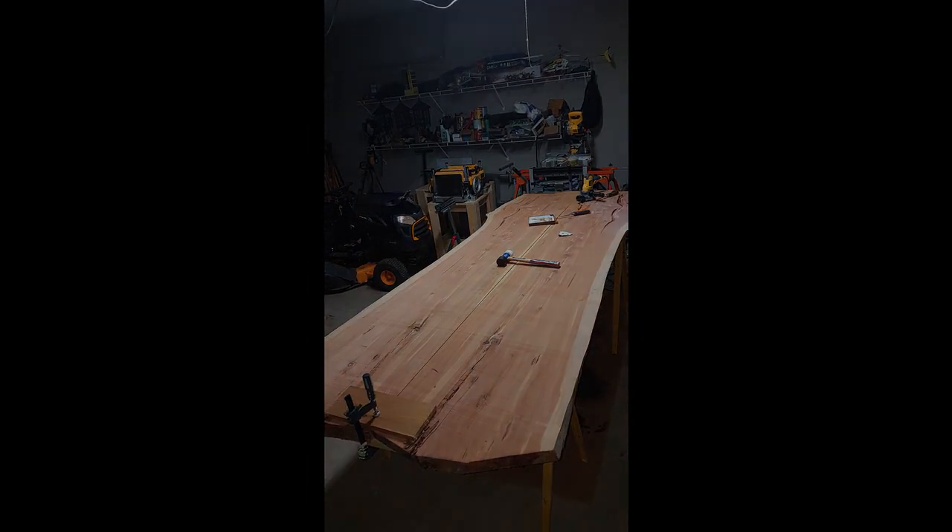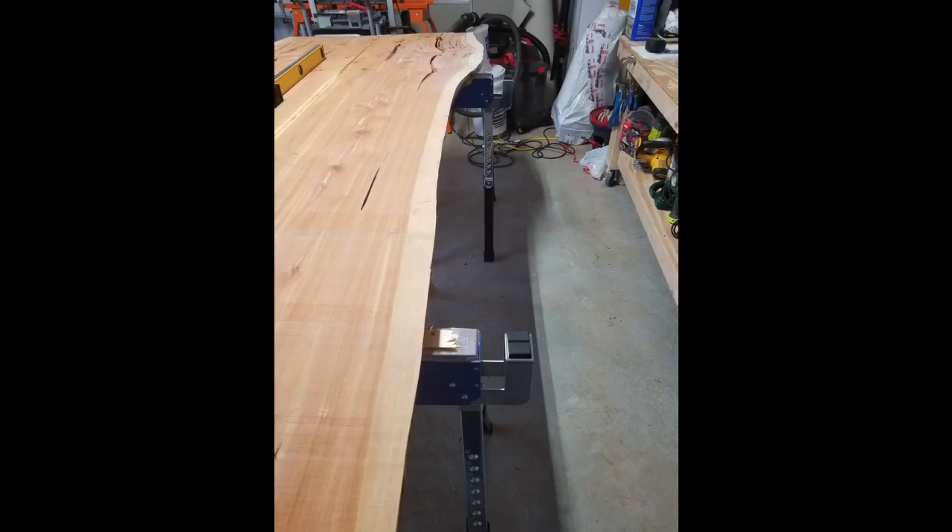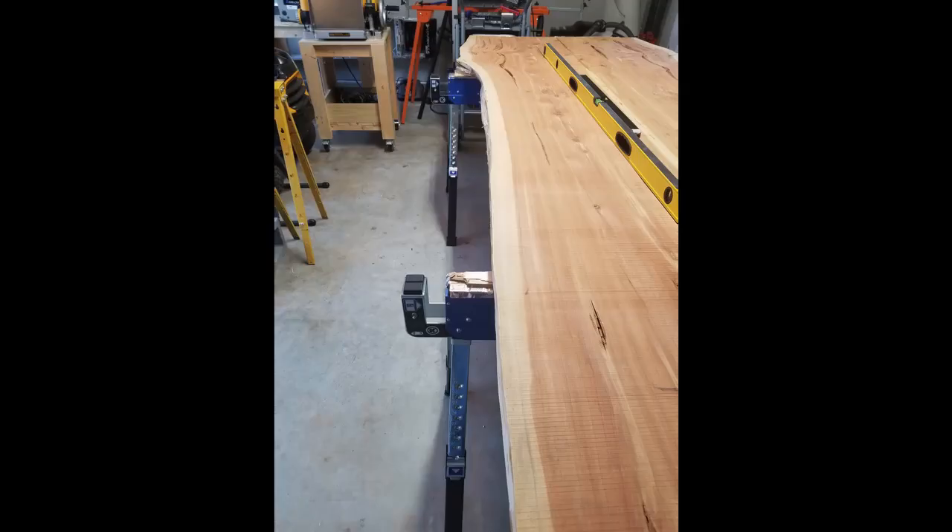On the bottom side I used colored epoxy, but then I decided to get some quick-set epoxy with a filler in order to make it a little bit sturdier. Since it did have a lot of punkwood on it, I was afraid that chiseling it all out would actually weaken the slab.